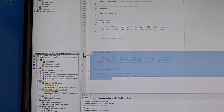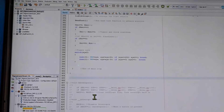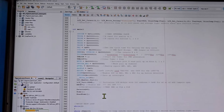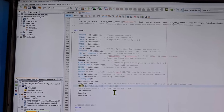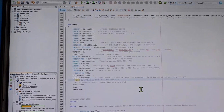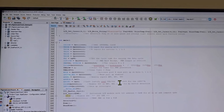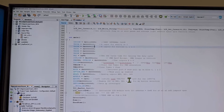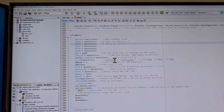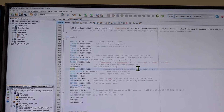So I'm going to turn all this stuff off. Instead of deleting it I'll just hit Ctrl+Shift+C and it comments it all out - it's still there in my overall project if I want it, but when you hit compile it just doesn't compile that into the software. Right now I have that stuff turned on with no interrupt service routine, so I'm going to go ahead and remark it out. I like to remark a lot of things instead of deleting them because a lot of times I copy stuff over to new projects. Now we're going to change these - turn these inputs off, so the tri-state register B. Going down here and changing it to zeros - none of them are going to be inputs anymore.